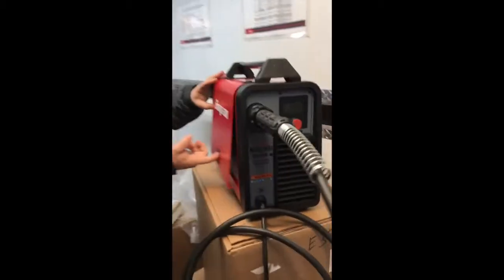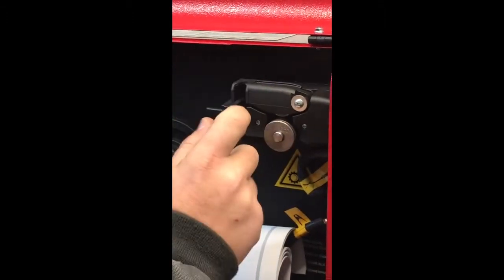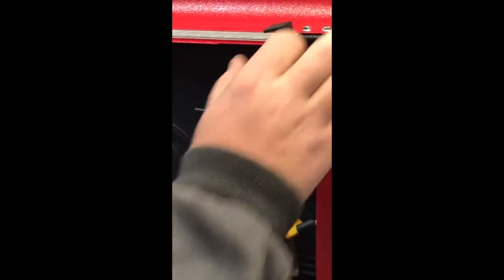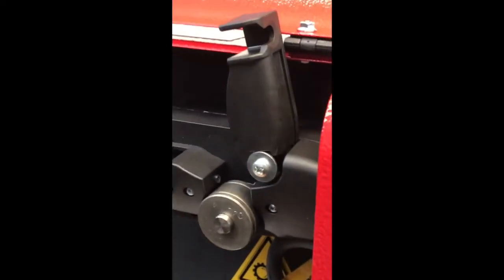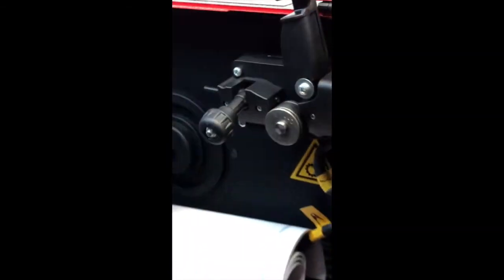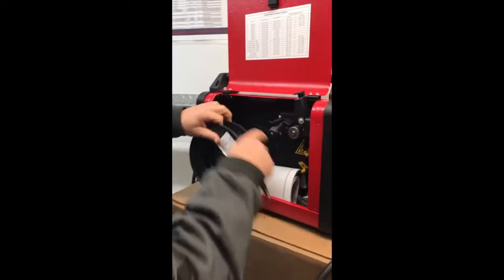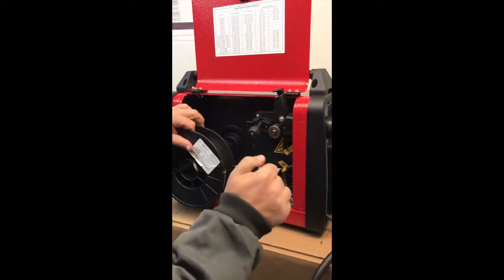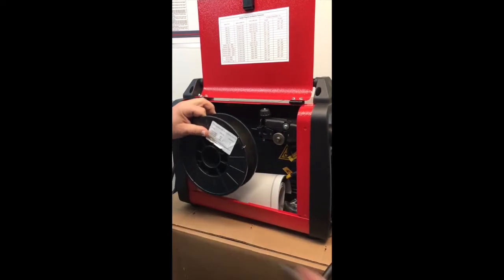On the inside here, this keeps pressure on our drive roller. We'll drop that down and flip this up. You can see that little bit of Teflon inside that hole right there, just before the roller — so we're going to feed it into there. We'll take our roll of aluminum wire, cut it off so it's nice and straight, mount the spool, push the wire through there into the Teflon, close this down and put the tension on it, and then you'll be able to feed it right through the torch.